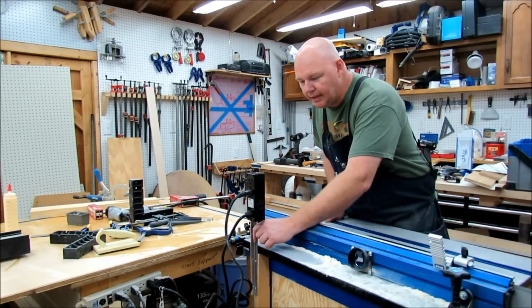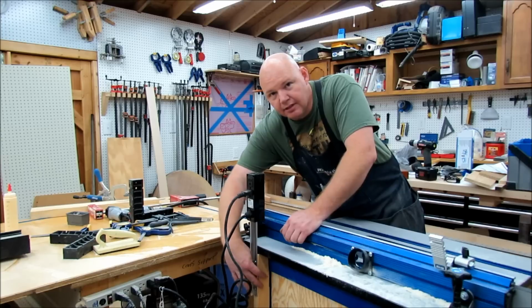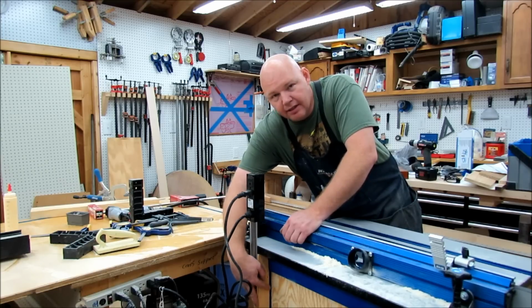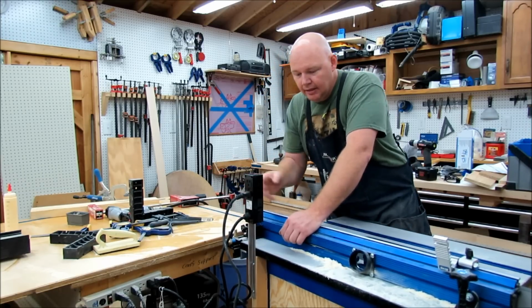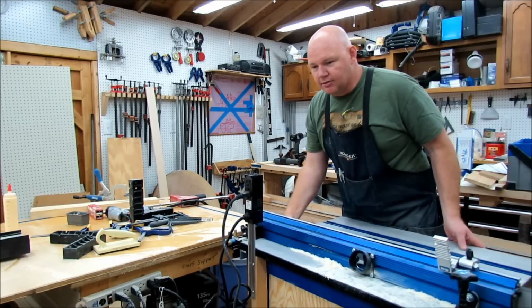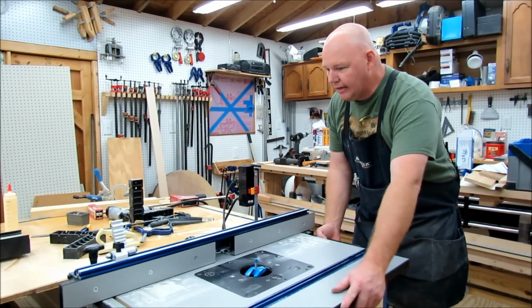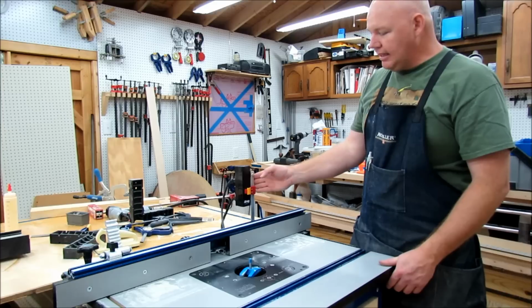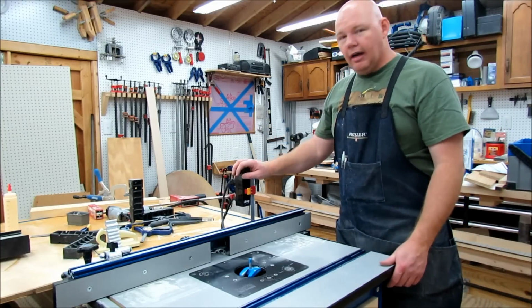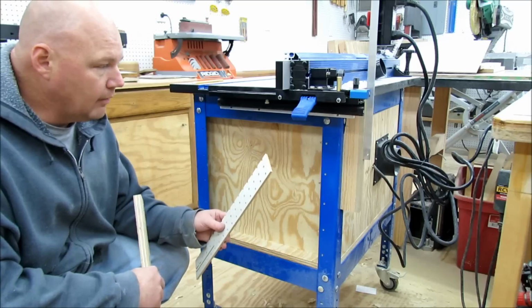All I did was take a piece of aluminum angle iron I had scrap, and I just screwed it into a block, and the block is screwed into the metal frame. Makes a really solid switch location. I've seen it on a lot of industrial machines where, you know, like planers and joiners and things like that in a big industrial shop where the switch is just above. And it puts it in a nice, easy to see spot where I could turn it on and off easily. So I just wanted to comment on that.